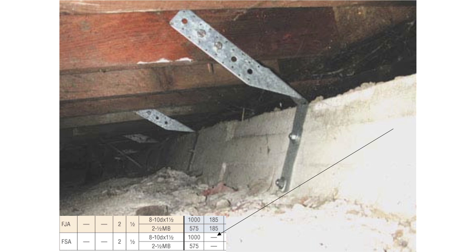Here's a piece of similar hardware known as the Simpson FSA. At the bottom left, I have a snapshot of the manufacturer's catalog, and the black arrow points to the fact that this hardware has zero resistance to earthquakes according to the hardware manufacturer. Again, this work was done with a building permit, it was signed off by the building department, and it was done by a contractor who was not trying to cheat anybody — he just did not know what he was installing. That's why you need to do the job that the building department and the contractor is supposed to do for you. You cannot rely on any one of these entities.